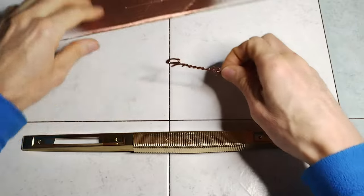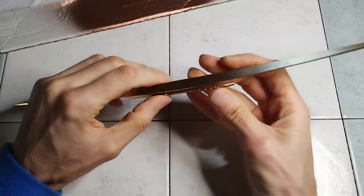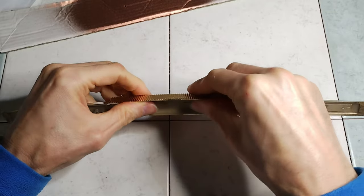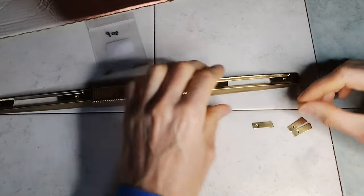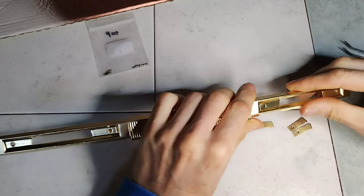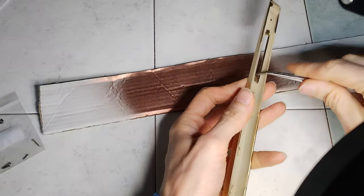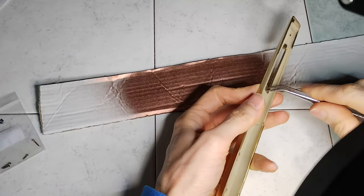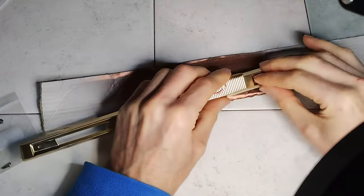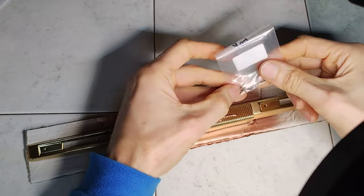Also, the plastic decoration that should be put at the bottom of the cabinet was rebuilt and reinstalled. The pieces of brass serve to protect the plastic where there would be the most intense wear by operating the tone control potentiometers. This plastic decoration is installed on the cabinet using four tiny brass screws of different length. The couple of screws most external are the short ones because there the decoration is thinner.